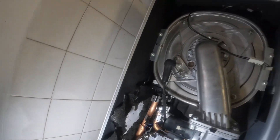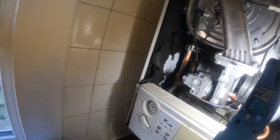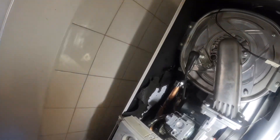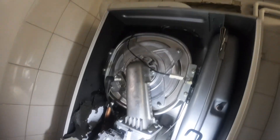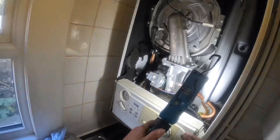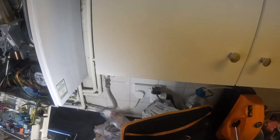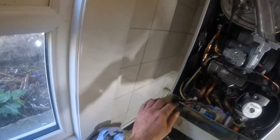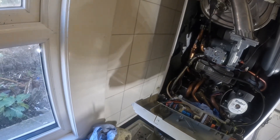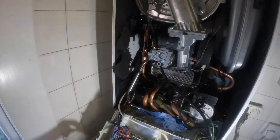Here I'm filling up the boiler and checking those pipes, because I wasn't sure if they were going to hold - double checking all the time while filling up. I also had new knobs for the front, so I'd brought pretty much everything I could see was needed. Here I think I'm getting the stubs of plastic that had broken off - they were into the potentiometers on the circuit board - so I was able to put in the new knobs.